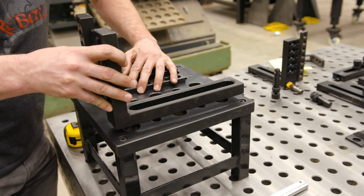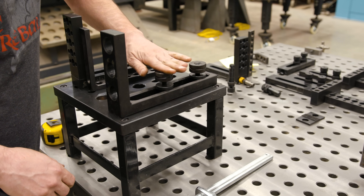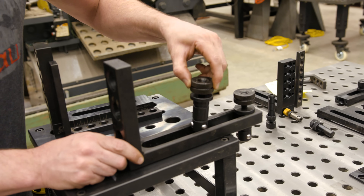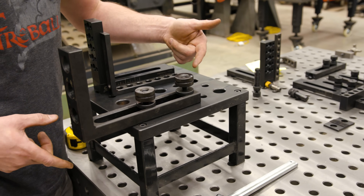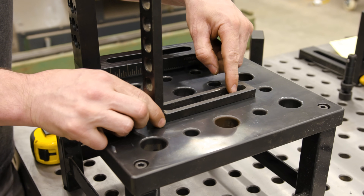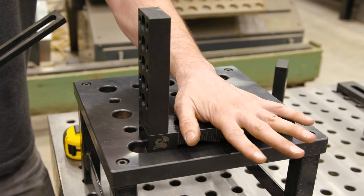The system 28 requires you to have a really, really long slot that allows you to go from hole to hole. The 4-inch hole spacing requires you to have a much longer gap so you can jump over to the next hole and do this leapfrogging to slide the fixture where you need to go — so you're really paying for a lot more length, which is unfortunate. When you look at the 2-inch grid pattern, it's much nicer — you can grab the next hole over every time, it only requires you to move 2 inches. When you combine all of that together, you get the best of both worlds: the 2-inch grid pattern with the heavy-duty clamp.